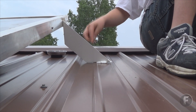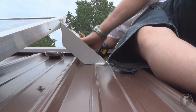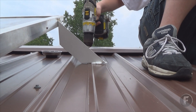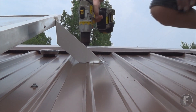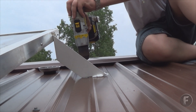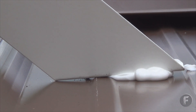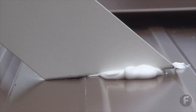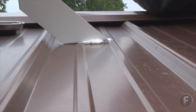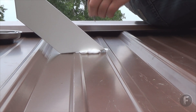Put the screws inside the bracket — inside here — then put the head on top. You're going to need both arms to push on that. It has to go through the middle. Then afterwards, use your finger and smear the caulk around. Make a seal on the bottom all the way around so we won't have to worry about water getting up underneath.